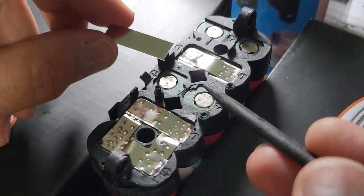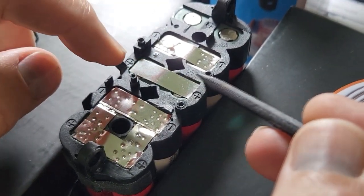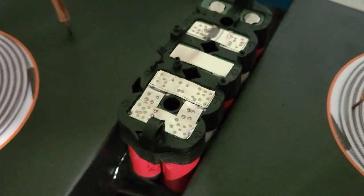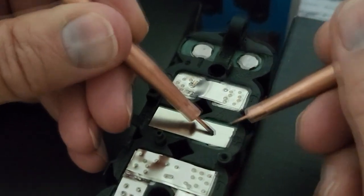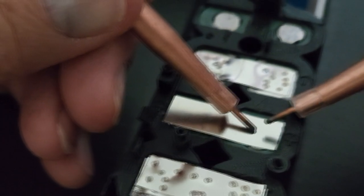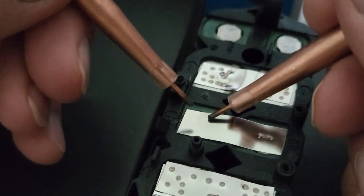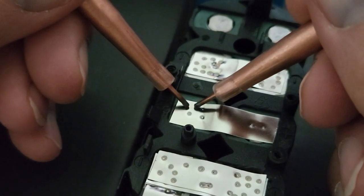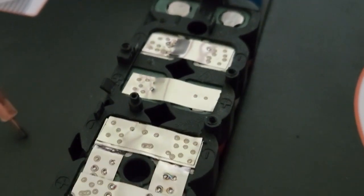I'm getting ready to add another plate joining these two batteries together, so I'm going to lay that gently there and make sure it is aligned properly. This is my welder and it's designed for spot welding. I have one second after I press this terminal down and it'll discharge. And that's basically how you weld all this back together.